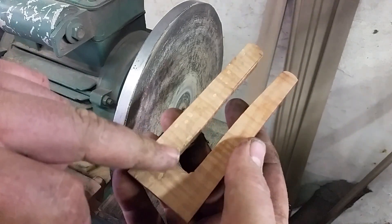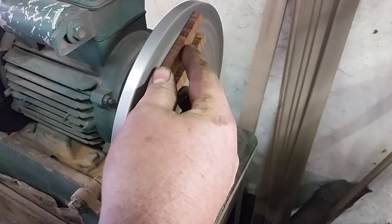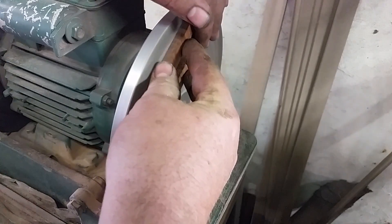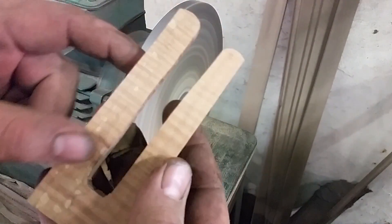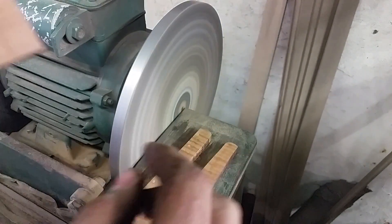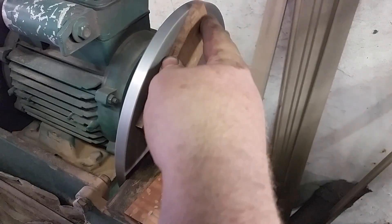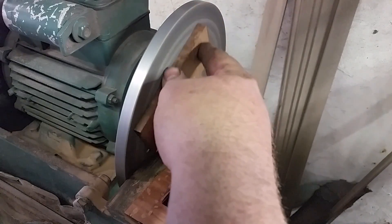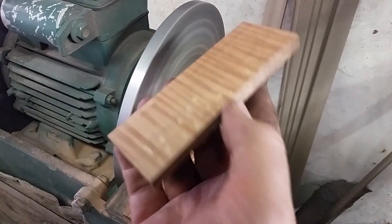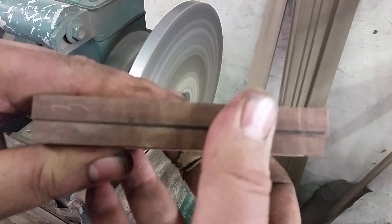You've got to be careful — don't push too hard, because you've reduced your surface area by cutting out the hole in the middle. When you put it on the sander, just gently with even pressure across your whole hand. You can put pencil marks all over it to test where the high and low spots are. The paper in my disc sander is not very fresh — I don't want it too fresh because we don't want to remove too much material. So we've got two pieces that are now incredibly flat.